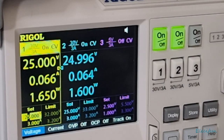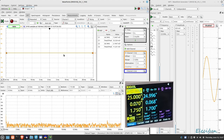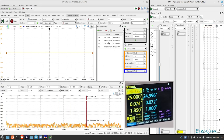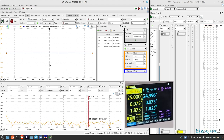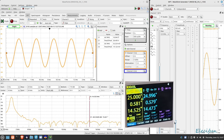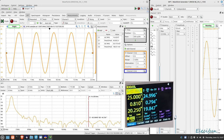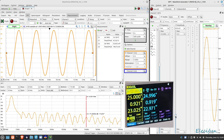Let's start the tests now. In the waveforms software we've got five volts per division, channel one, time base at 500 microseconds so we can see a nice sinusoidal curve. Switching the signal on and going up on the input — we've got a peak-to-peak of 30 volts. Keep pushing it up to where it starts clipping — I can see it clipping top and bottom symmetrically. Backing it off to around there and adjusting the timebase so it's easier to read.